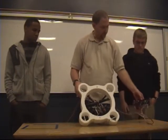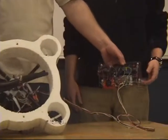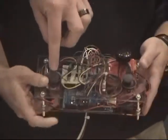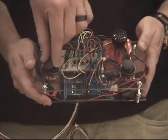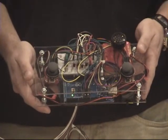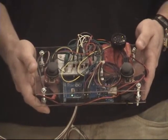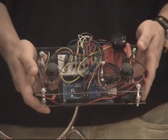The controller is made primarily from an Arduino and a little breadboard for prototype purposes. We have two joysticks on there. The one on the left, up and down, controls the main throttle. Left and right puts an offset speed into the main propeller — it'll speed up one and then slow down the other so that it creates a general torque, a moment in the plane. It'll cause it to yaw or rotate in one direction or another.